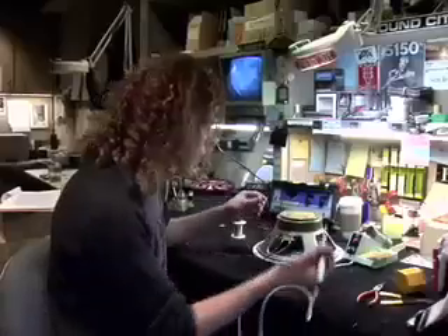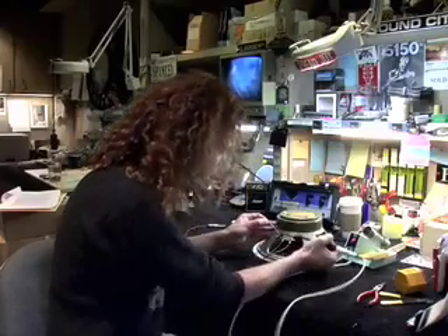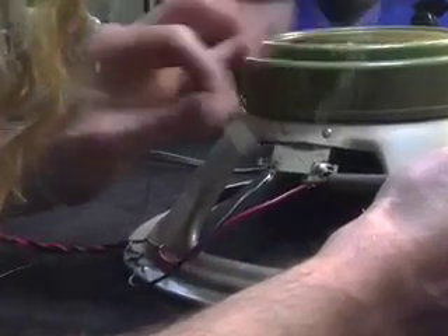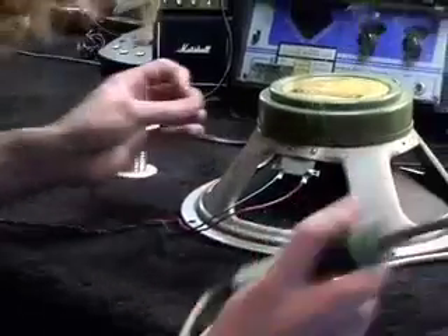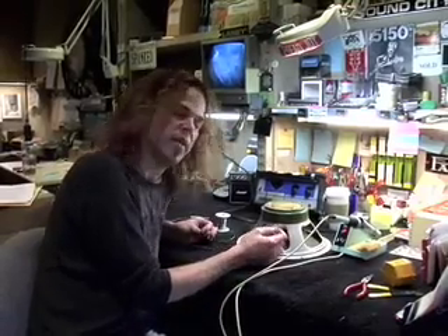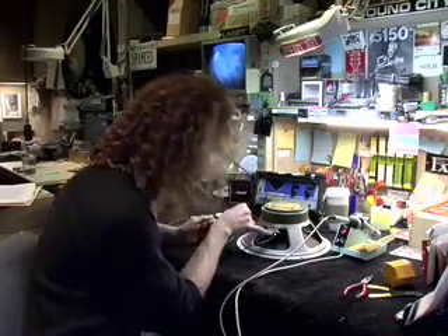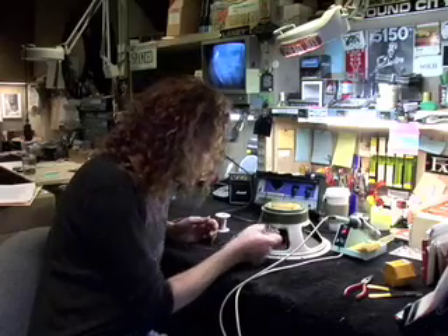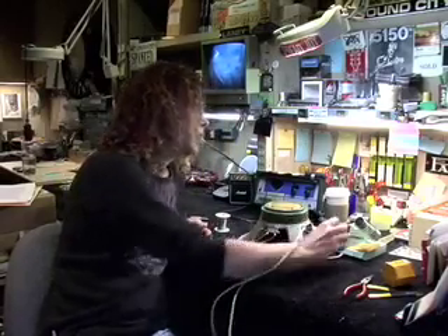Take your iron. You've already got solder on your wire and you've already got solder on your lug. I'm going to lay the soldering iron down to create some heat, and then just lay the solder into the area I want connected. Same with the black, the negative terminal — lay it on, create some heat. You don't want to leave the iron in the area any longer than you need to — only as long as it takes to make the solder molten and connect with the terminal and the wire. Your joints should look pretty clean. They should be clean and bright silver, meaning you don't have any residue and you haven't melted any of the jacket into the connection by mistake.